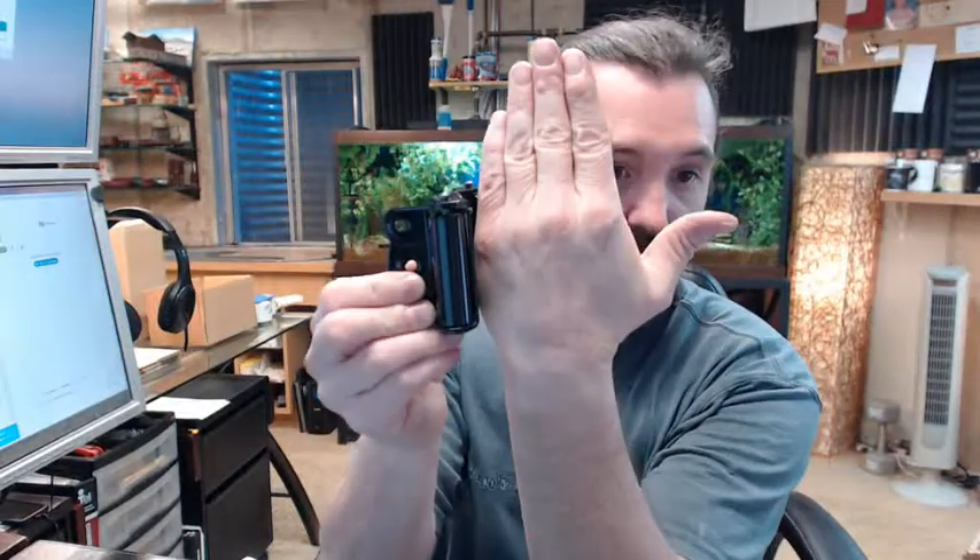So again, one leaf is going to mount surface to the jamb, then your door is going to fit in this pocket and you will attach it here. So the door can double act, meaning that the door can swing out this way and then the entire unit swings out this way — that is how it works.